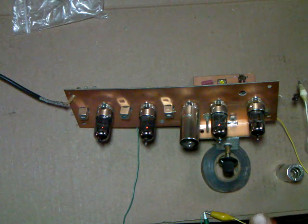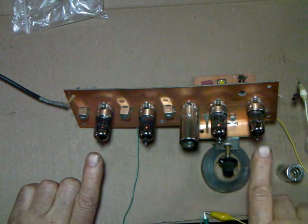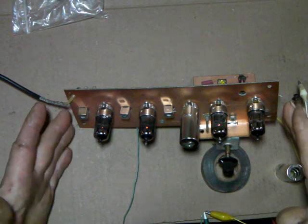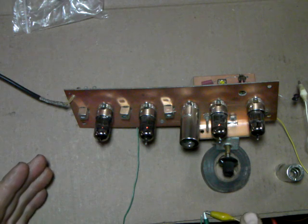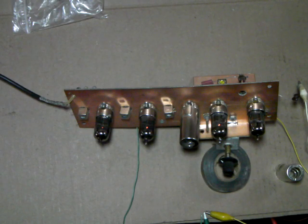He didn't come in too bad. So anyhow, there's the receiver — now fully running on 12 volts. If that's something you want to play with to see if it'll work on a little bit lower voltage or just for more gain, try to use the 6CB6, six Charlie Baker six tubes. It's amazing — the first two that I changed in the IF section made the largest difference. The one in the RF amp didn't change so much, but it could be due to tuning. I don't have any way of retuning on this little simple demonstration board. We'll get around to looking at that more when I actually do the build on the receiver, which I'm just about getting ready to do.